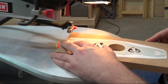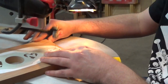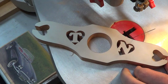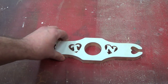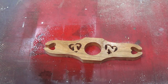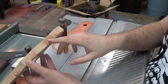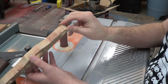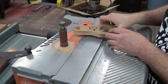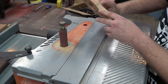We finish up the edge and work on the inside of the glass holder area — and there's our finished cutting. Time to remove the pattern: I spritz it down with some mineral spirits and after a few moments the pattern practically falls off on its own. These are the burn marks left by the blade on the cherry. If I was smart I should have laid down some packing tape as a blade lubricant, but now I have to remove the burns on my own.